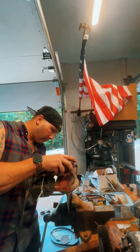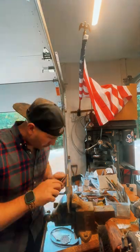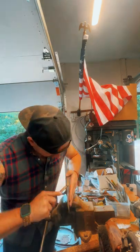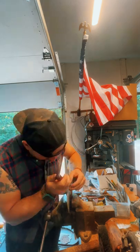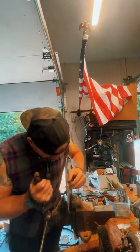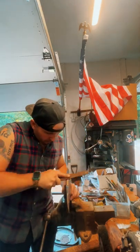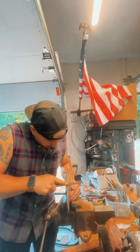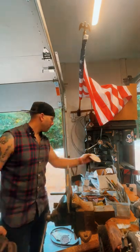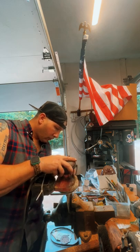When you're really driving that wedge in, sometimes you'll get a little bit of overhang on the wood, and so the chisel cleans it up pretty well. Get the shape of everything looking right. Now once I have that how I like it, I use a hand file and go over it to get rid of those swirls from the 60 grit sandpaper. Once I have that cleaned up, I go to a 400 grit sandpaper and go over it one more time, and that really just helps give the wood a nice smooth surface for whenever you put the oil in there.